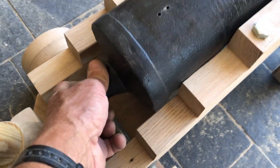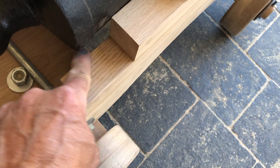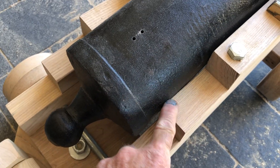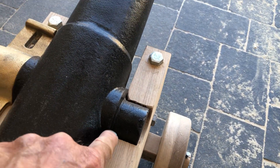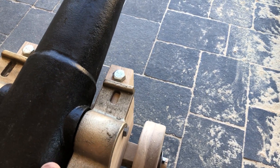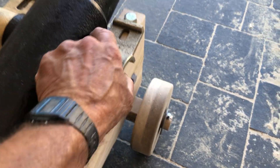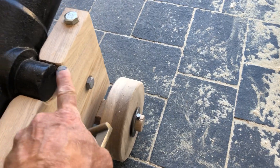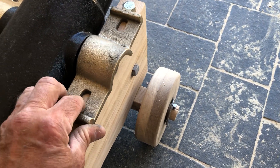I have a little tolerance issue right here — it's not falling, I've got some interference here, and this part is tight. This part right here I could do some grinding on, and in order to get the barrel to fit right I actually had to do a little bit of grinding with a sander on the inside in order for it to sit down flush. These trunnion holders are supposed to fit a two-inch diameter, but this is not a two-inch diameter even though the hole I drilled here is exactly two inches — so it fits sloppy.